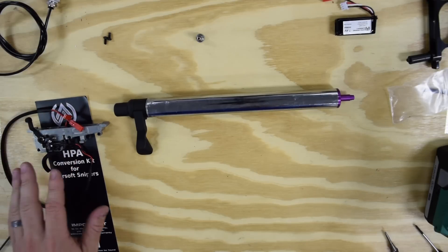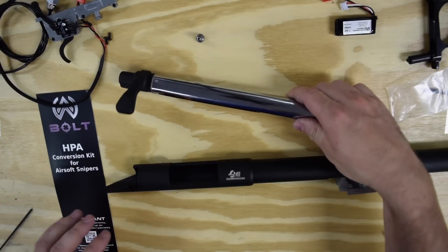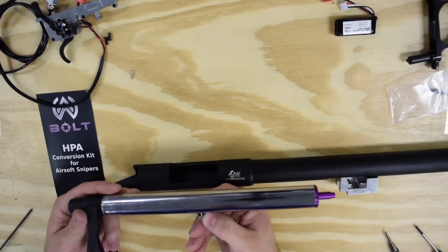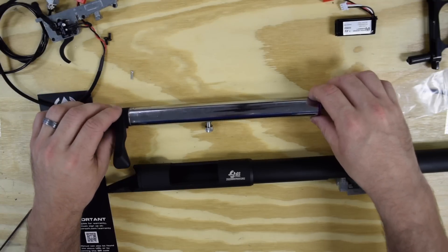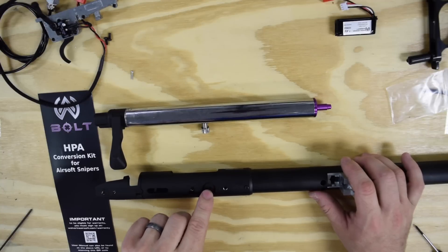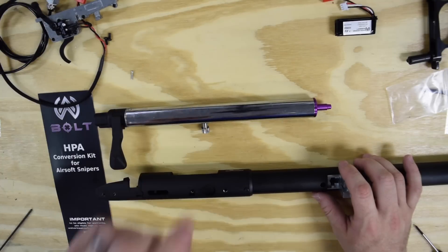So there it is installed inside the cylinder — we have our cylinder done and our wiring done. Really, all that's left is routing the airline. We got our receiver back out here. We basically need to drill one main hole in the receiver. The way this works is the airline fitting will go through the receiver and thread into the bolt itself, held in place by the receiver. When you cycle the bolt, all you're doing is sliding the cylinder around the stationary unit. On standard JG and Tokyo Marui VSR-10 systems, there's a really easy marker — this molding mark. We're going to drill our hole right in the middle of that. We'll post a link in the description for other rifles where this molding mark is not present.